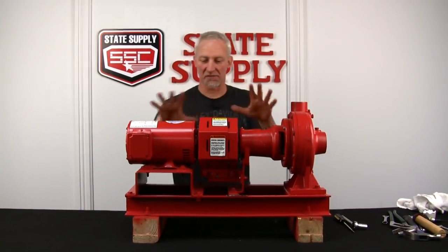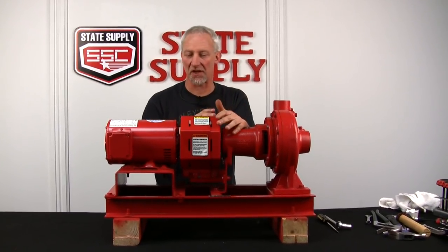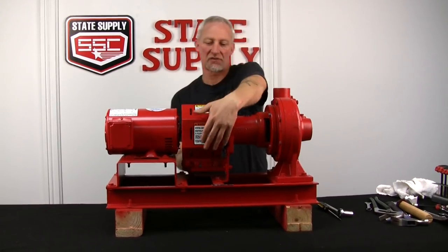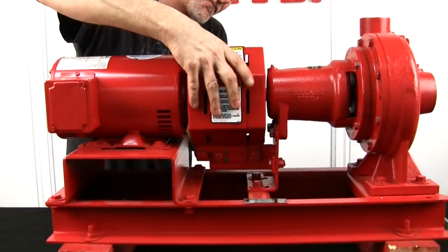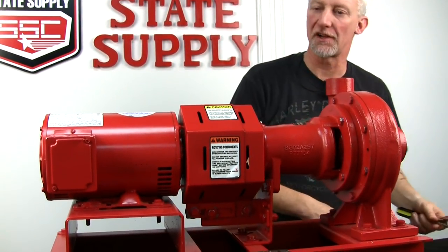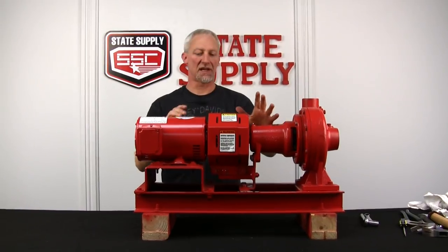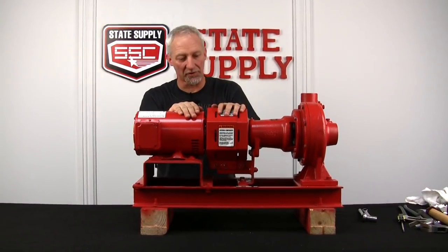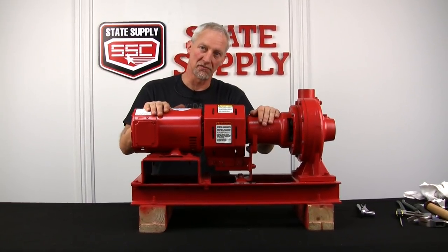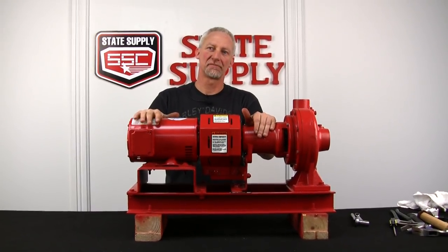Now that they're finger tight, I'll make my final adjustments on the coupler guard. You want it spread as far apart as you can get it without touching anything — without it rubbing on the shaft of the bearing assembly, the coupler, or the motor shaft. Eyeball the spacing, spread it apart, and snug everything up. Take a final look at it: make sure it's not touching any shafts or the coupler. Then you can turn your power back on and start pumping water. If it's time for maintenance on your bearing assembly, grease it while it's running — a couple of shots, you'll hear the grease enter the bearing with a gurgling sound. Perfect time to do it is right now. Thanks for watching.